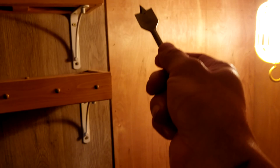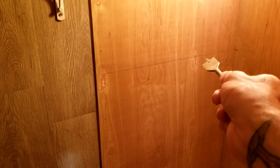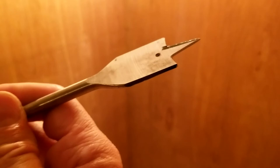And then run it across, or actually here, because I can mount it to that 2x2 inside there where the lines are, and have my faucet, the part where you turn it on, and then the part that goes up for the sprayer. What I'm trying to tell you is that the sprayer's going to have to be on that side when normally it's on the side with the drain, because I don't want to run a pipe up and across the ceiling to come over to this side. That'd be ridiculous.